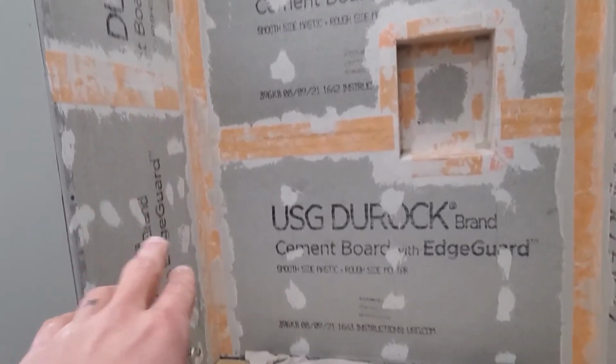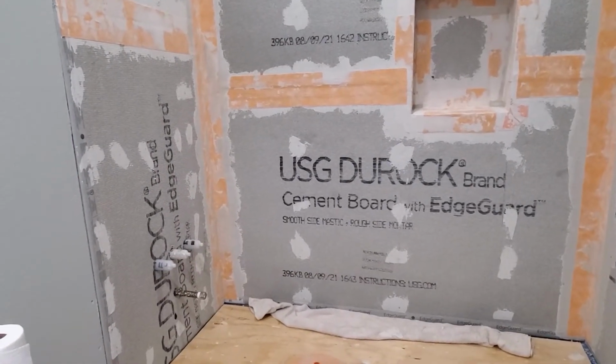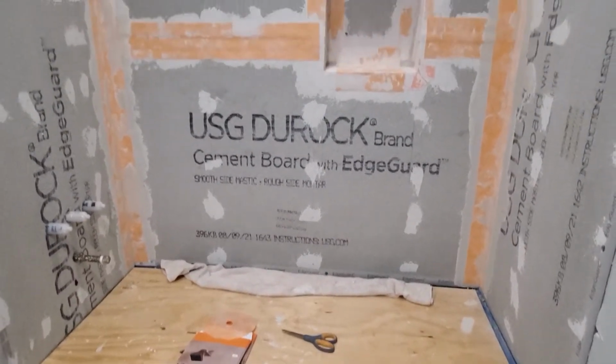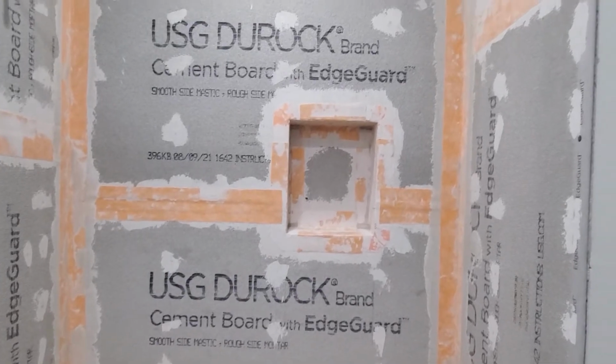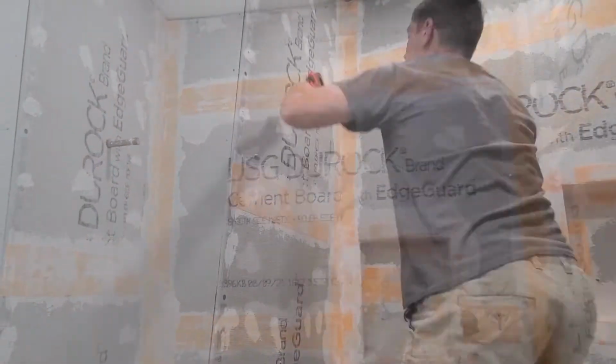I've looked into it. You'd actually do a little bit of different waterproofing around the valve handles that come out. But once I get those installed, I'll be ready to start painting on the waterproofing membrane, and that will mean the shower is ready for tile.